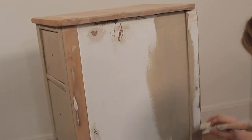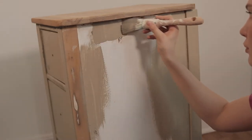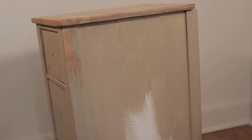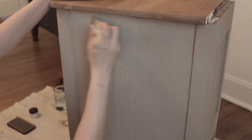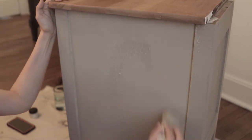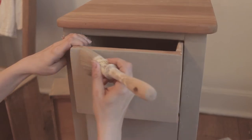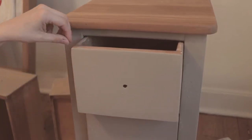You can see the first coat of milk paint is looking pretty streaky and splotchy — that's totally normal, especially because of the finished surface I'm working with. If my vanity was solid wood without any paint, it would have soaked more evenly through. But because I have areas of raw wood, areas of Bondo, and areas of latex paint, the paint is going to look very splotchy due to those different surfaces. When I came back to check my second coat, I noticed that the entire piece was extremely crackly — a very distinct crackle finish. I was very glad I had chosen a milk paint color that complemented that white paint underneath. I would probably not have gotten this crackle finish if I had added bond to my first coat, but I was out of it and just wanted to get the project done.